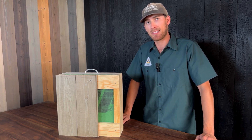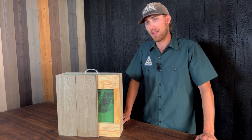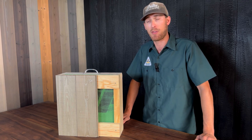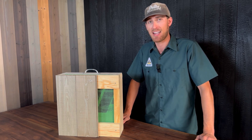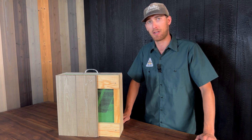We do see a lot of failures in siding systems when people install the siding directly up against the sheathing. There are two issues with that: first, there's no ventilation and no opportunity for the wood to dry out after being wetted. But the next biggest issue is that a half inch of bite into exterior sheathing is not nearly enough holding power to hold the siding up against the wall for a long period of time.